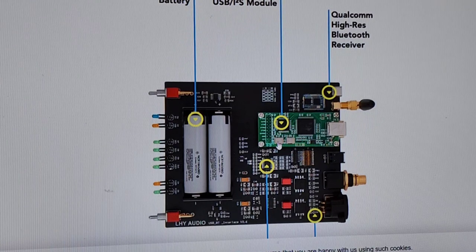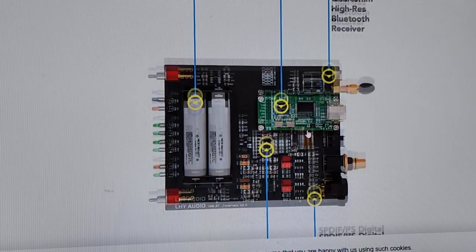Do they even talk about the two clocks here? Do you see these two? Those are the two clocks. Do they tell you what the jitter spec is? No, that would be important for this if they're going to give you some spec. And look, what do we have here? An FPGA. Well, they don't mention the FPGA, do they? Well, wow, that's because it needs a freaking FPGA.